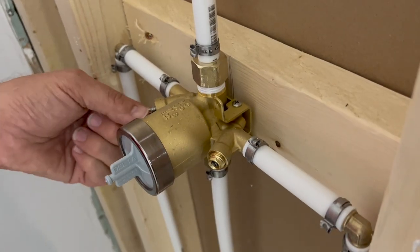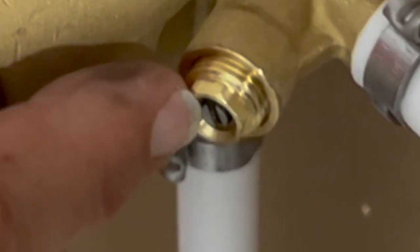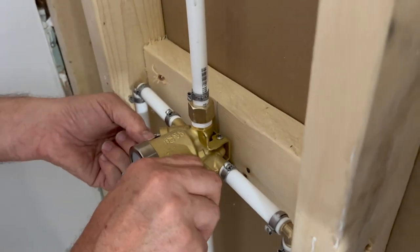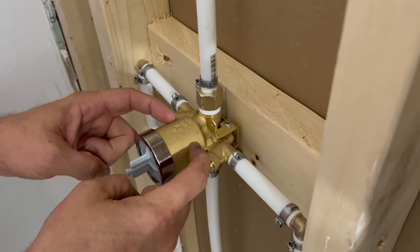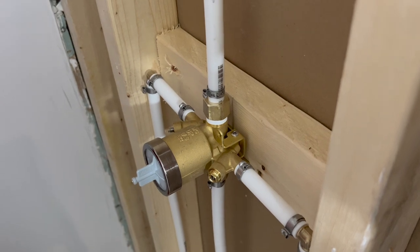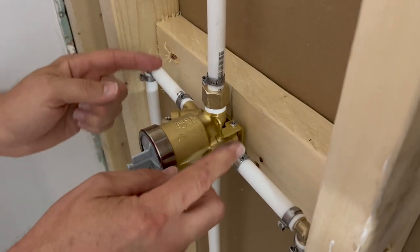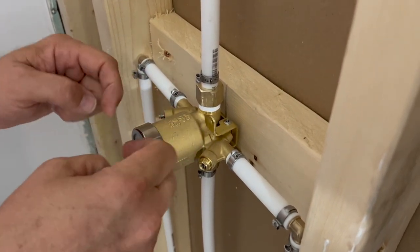How you turn these is right at the end of the screw that we just put in — there's a little groove there. That's where you would turn these with your screwdriver to impede the water flow. It's going to stop the water flow from coming into the valve, which then can divert it to your shower head or your tub's valve, closing the water off right before it gets into your valve body and through the cartridge.